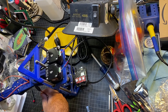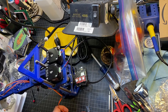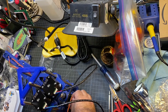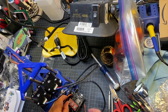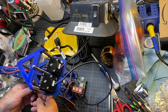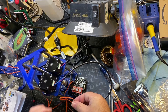So the first one I plugged in was the wrist servo. Based on the sheet, that goes into the serv2 port. Serv2 is this header right here, and it's a 3-pin. Ground is going to be your brown wire, and that's going to be on the inside, so you're going to plug it in just like that. Hopefully you can see that — brown on the inside. And then the second one is just going to be servo one. Do the same thing — brown on the inside.